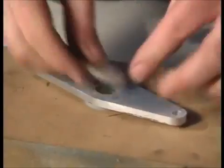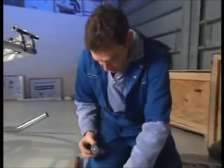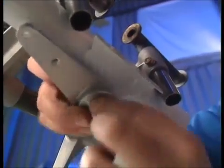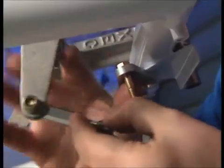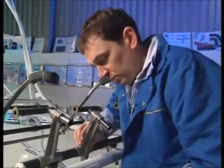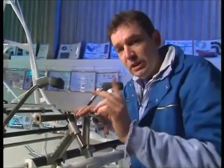First job is to knock in some nylon bushes on both sides, then put in a tiny amount of grease, and the bolt goes in. Now we're ready for some connector rods. A scissor is a very simple piece of engineering — but look at that: one forward, one back. Superb. Now all the kit's on the aircraft, but it's got to be connected up to the bits it controls. I need some control cables.